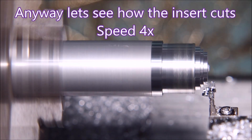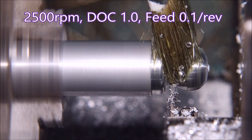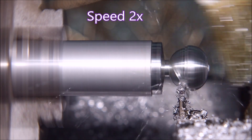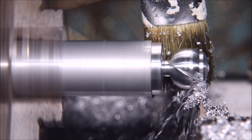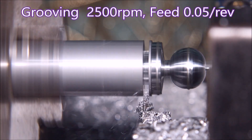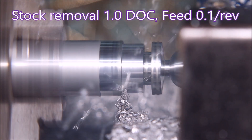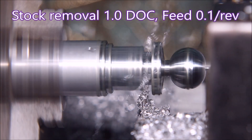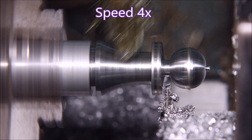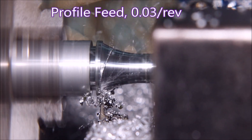This is where the tool has been reset, but is now actually cutting too large a part. As you'll see from when it goes round the ball, there's a big nib left on the centre which shouldn't be there. I'm fairly impressed with how the thing cuts sideways. Making a groove there so the tool can go into the part free of cutting material for the stock removal cycle. But I think I'll have to check whether it will actually do that — it's only feeding I think there, so if it's only feeding it may actually be able to do that without those grooves. It would be interesting to find out.